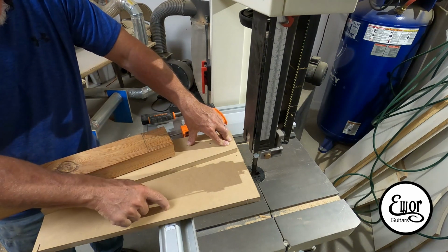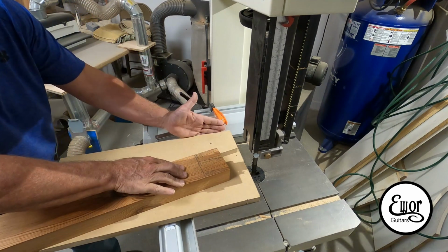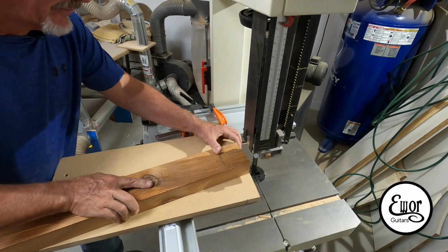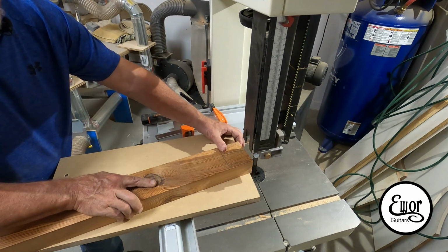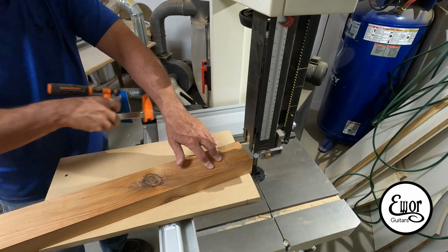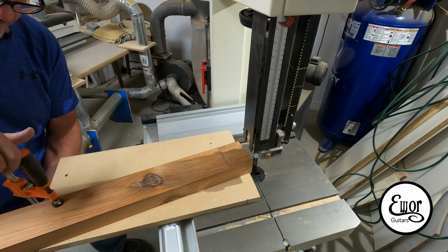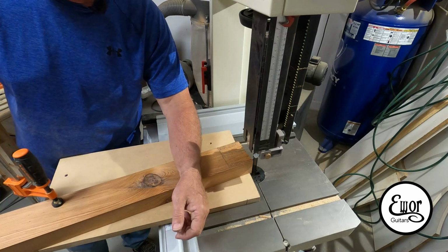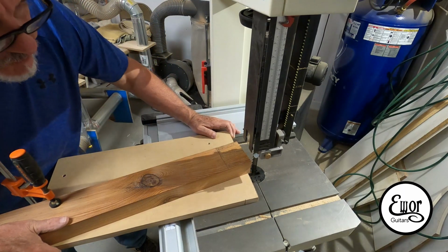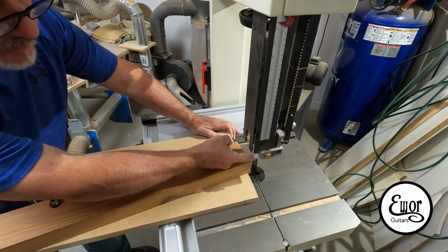What I did is I screwed it to another piece of MDF just as a backboard, and this one side is just a straight square edge, and that's going to go up against the fence. And my board is going to lay on top of this. I'm going to clamp it to the lower piece of MDF, and I'm going to run it up here. I'm going to reference it off of this top corner up here. Right here, it's touching the end of that first piece of MDF, and that should be my reference point. Then I'm going to get my clamp down on this end, and I'm going to clamp this board onto here to keep it nice. And because this is a 6 foot long board, the other end of the board, I've got it on one of those outfeed roller type of things. So anyway, the idea is, I'm basically about 5/16 of an inch in from the edge of the board to that face of the blade.